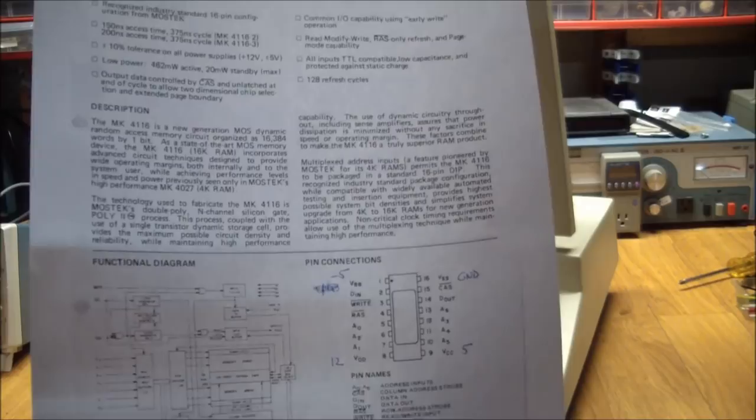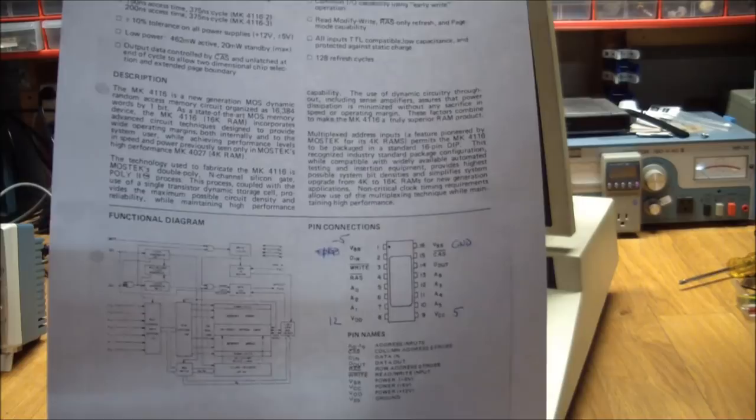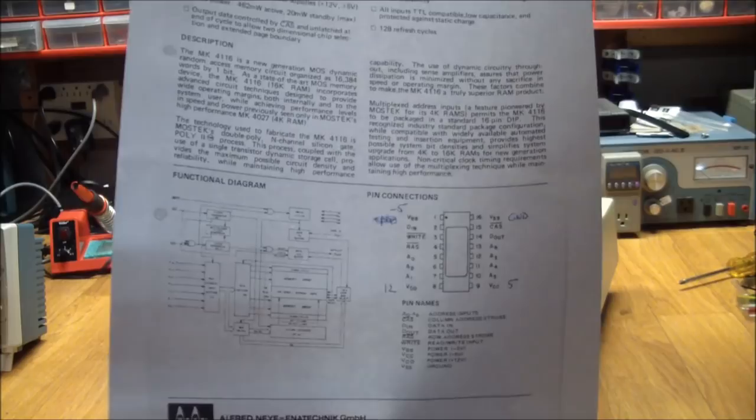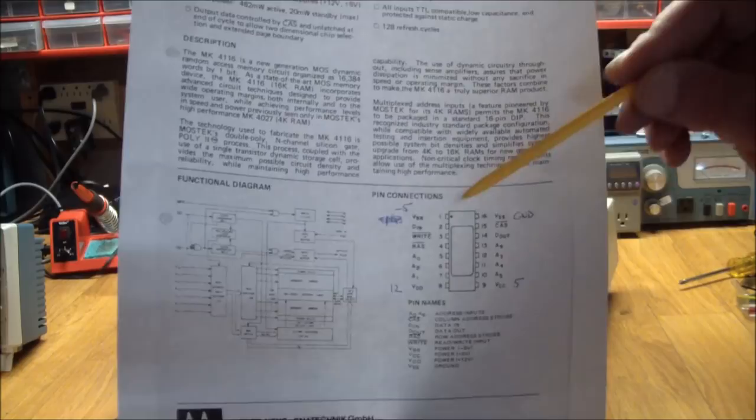And the voltages should be pretty close. Measure the ripple, which should probably be less than about 200 millivolts. I mean, usually when you measure it, it'll show about 200 or 300 millivolts, but you should see it go down rapidly, depending on your meter's resistance. But you do need to do this check before doing anything else with the motherboard.